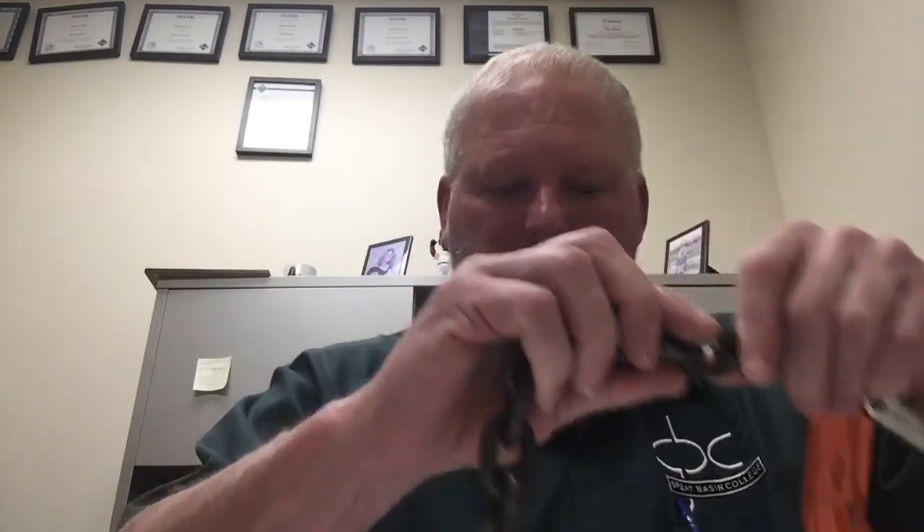The chain link consists of two sides. Failure of either side causes the link to open and break, falling off the next link as it stretches. By comparison, wire rope is usually made of up to 114 different strands that have to slowly damage and break. With a chain, it's one link — if it starts breaking, it's going to go rather quickly.